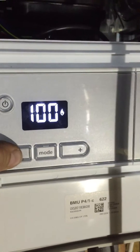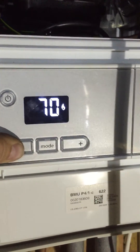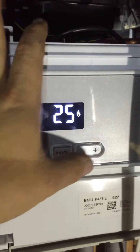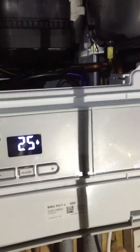Hopefully that helps. You can play around with some settings if you want — you can take it down to 50%, and like I said they don't want you to do a minimum check, but you can always take it down to around 25% maybe. That's probably not going to be far off your heating minimum load if you wanted to experiment with that. To exit the screen, just press the mode button back again and away you go.